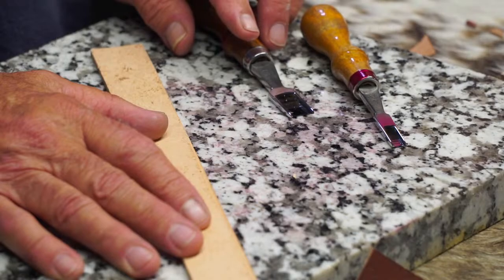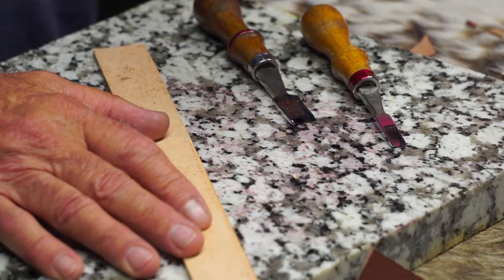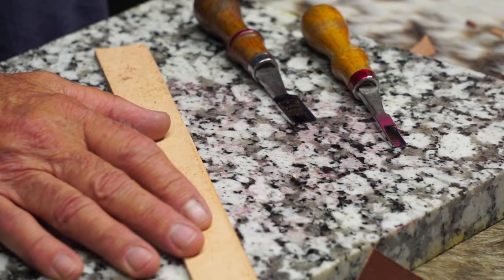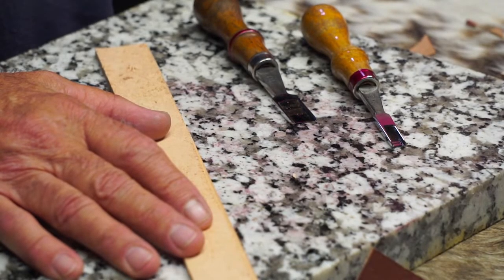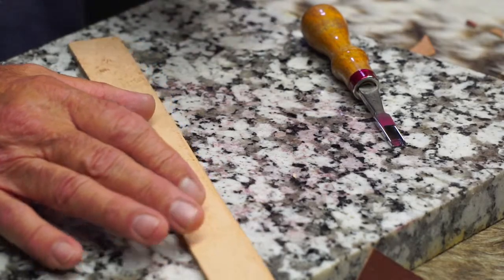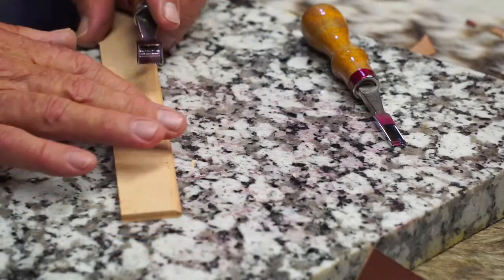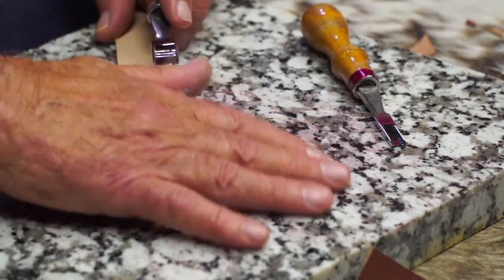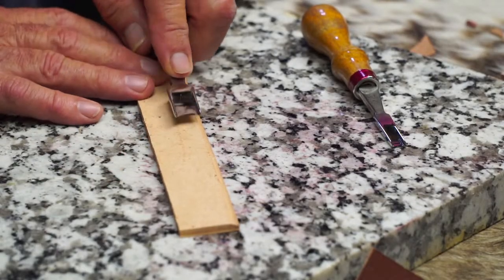You just need a polish. Plus, especially a punch, they will grind that around and around to make that taper. The grind marks are going around horizontally, helical, and you want them vertically, so you've got to strop that off. It'll make it cut 100 times better. And edge bevelers, use a little piece of string with jeweler's rouge on it, so you strop those. Yeah, Wayne, we talked about that before.